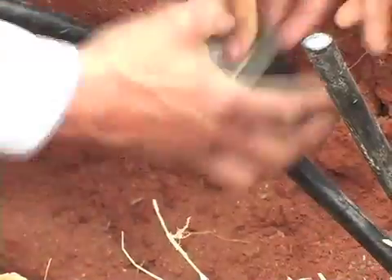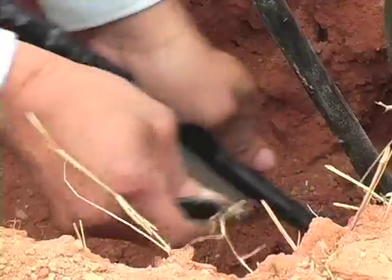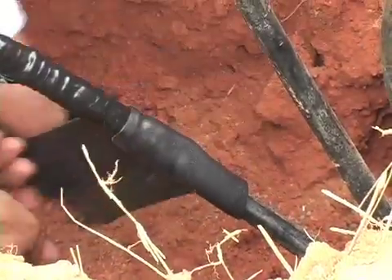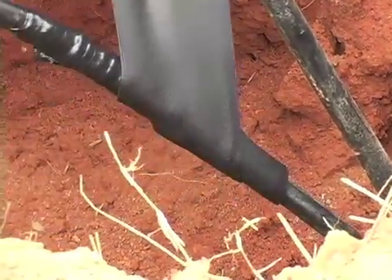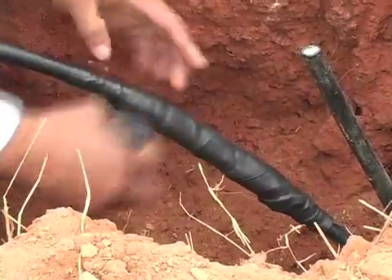The connection gets three layers of insulation. The first is a wide electrical tape. The second is a special rubber compound that sticks to itself and seals to make the connection watertight. The final layer is regular electrical tape.